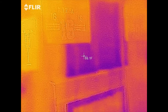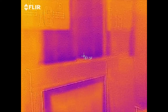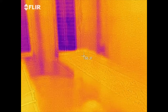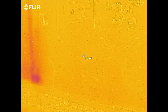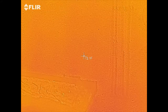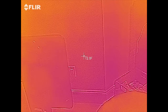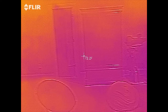Now we're going to see some windows here in a second as soon as it readjusts. Windows are always going to be a little bit cold. You've got to be careful for reflections — it takes a few seconds for it to readjust. The great thing about infrared is you see things you couldn't see with the naked eye; you're seeing the temperatures of everything. There's an outlet right there, so that's why it's showing up warm. When you have something abnormally hot or abnormally cold, that's your biggest finding — the main thing in this game room is the insulation.